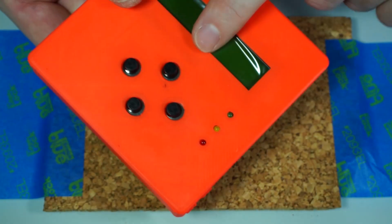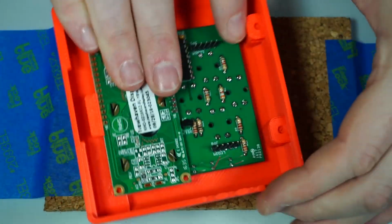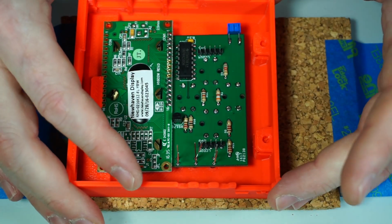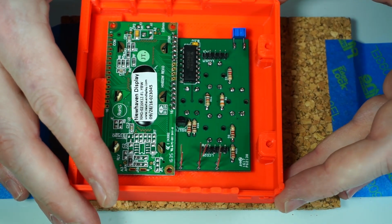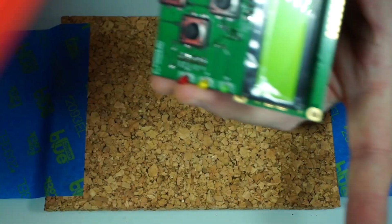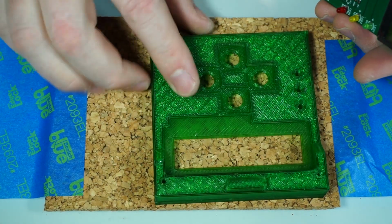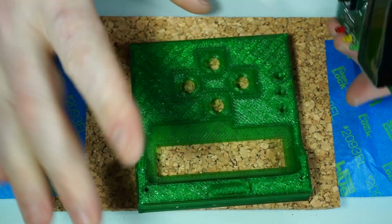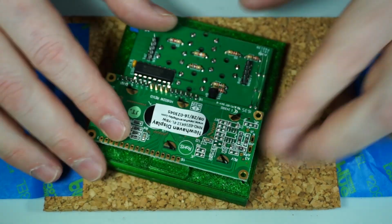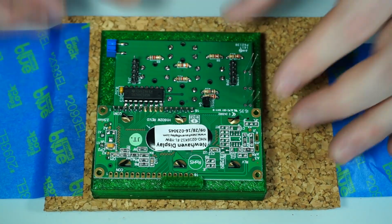You'll notice that when you do this, the buttons stick out the other side. So you'll need to put something underneath it so that it floats above the ground, like a tool under each side. Otherwise, you'll push the buttons down and it lifts up the whole board, which will leave you with the incorrect height. Because I do a lot of these, I made a special jig. It's a hollow bottom that you can load this thing up into, and it has no sides, which makes it easy to solder in from the side without melting a perfectly good case.